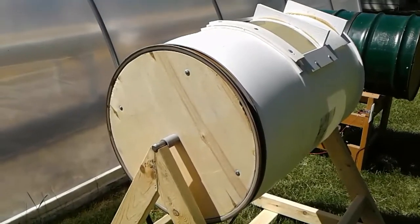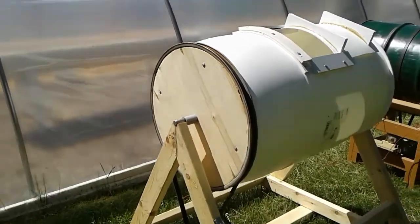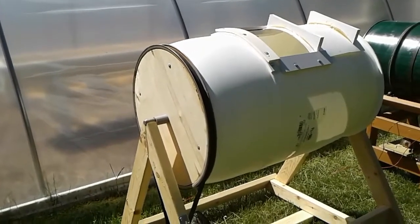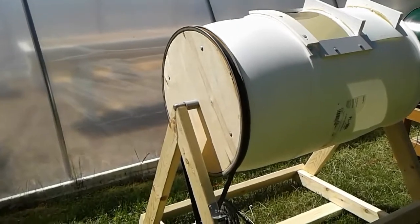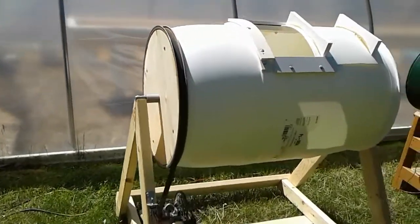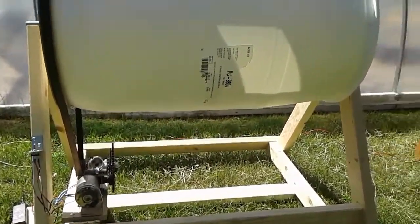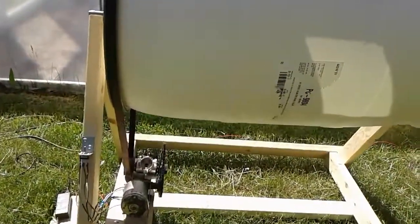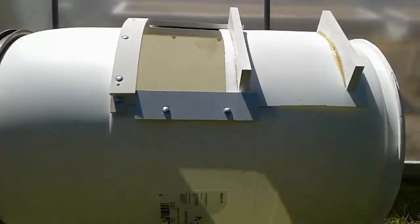On this side, it's the pulley itself that holds the bearing in place. Buying a 22-inch pulley would cost more than I care to think about, so I made mine out of three-quarter inch plywood and a bicycle rim, bolted to the side of the barrel. Then I mounted the same motorized system that I use on this composter.